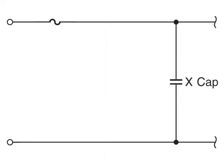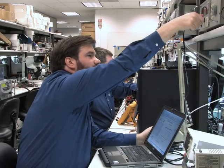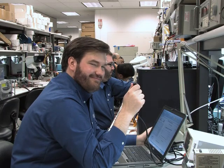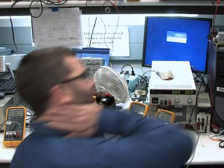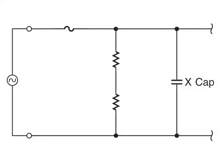Without discharge resistors, energy stored on the X-capacitor would be present across the input prongs of the power converter and could shock the consumer after unplugging the supply. But these resistors produce a constant power loss while the AC is connected and are a significant contributor to the overall no-load input power losses.